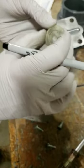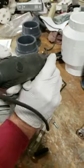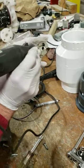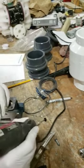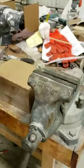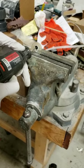I can't drill too close to the edge or it'll weaken this bumper up where it attaches here. It's very thin so I can't get in too close to that area. I'll use a Dremel here and just port this open. I'd probably use a vise to do this — I've done a lot of them by hand so I'm used to it, but you can also use a vise to keep it in place and not have your fingers in here. It kind of needs to be fast RPM to cut this material.